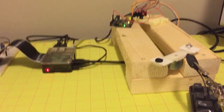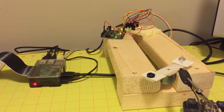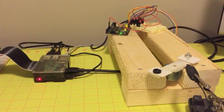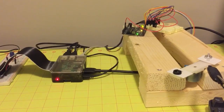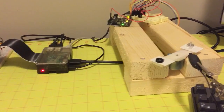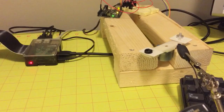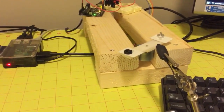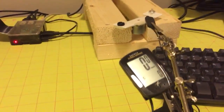Tonight I am extending previous demonstration videos where we exercised the Arduino that drives the stepper motor just directly from the Arduino IDE and the serial port monitor. If you'll recall, we can send values over the serial port line to the Arduino, and it will interpret those as commands to turn the stepper motor at that specified number of steps per minute. And that with two magnets, one on each end of the boom there, we anticipate getting double the cadence out of our tests, and we have the same cadence computer.